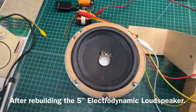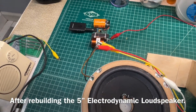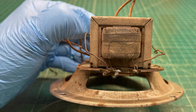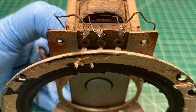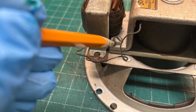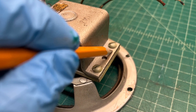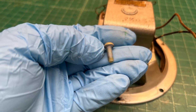I just got the loudspeaker tacked in, just sitting here in a plastic container with a little close proximity transmitter and just a few still photos for my reference when I put this thing back together. You can see me breaking it apart — the old crusty output transformer I'll clean up, and the terminal strip on the bottom where that center position was broke, so I'll place a new terminal strip on there.